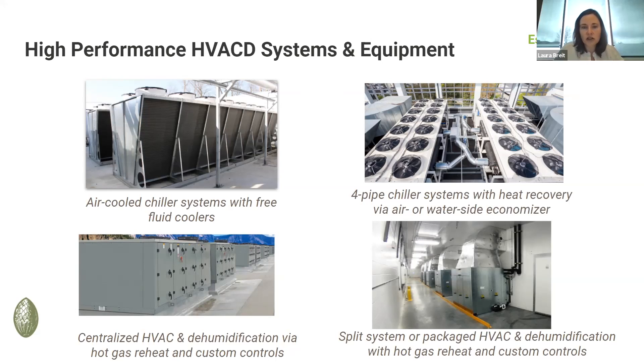There's also the concept of the heat recovery wheel, whereby the energy from the outgoing hot and humid air can be transferred to a cooler, drier incoming airstream without mixing airstreams or losing CO2 charge in the cultivation room. That's an important part — lots of times people hear 'outside air' and think you're throwing out all their CO2, but there is a method to do it without losing the CO2 you're enriching with.